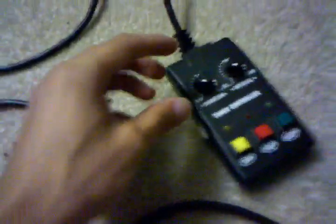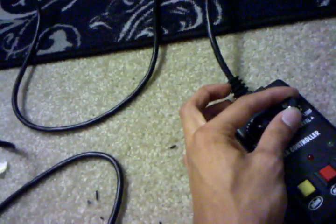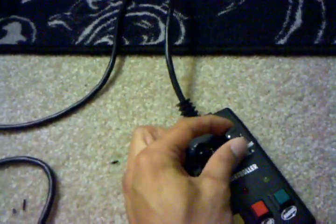Once you're done, you should have a timer that syncs your lights and fog machine together. For example, if you set your duration for about 0.5 seconds and your interval for about 10 seconds, you can have a red light or some other light fire in sync. I'm using this specifically for a cannon — I'm going to stick the fog machine behind some ABS 4-inch pipe with a red light on the inside plugged into this, since it's 120-volt AC, so the light turns on with the fog at the exact same time and turns off at the exact same time.